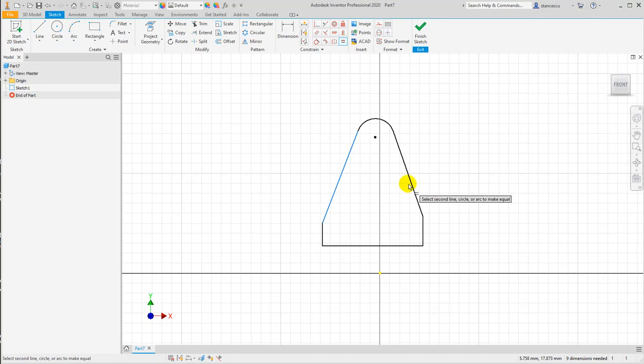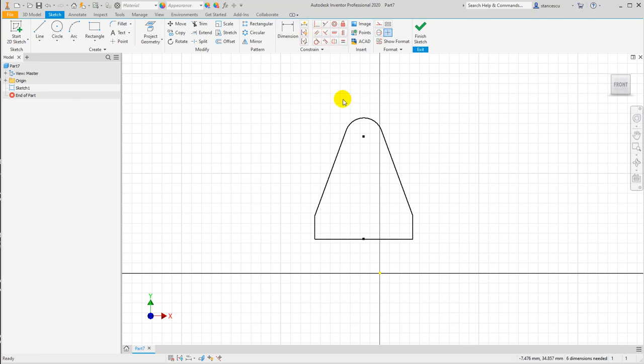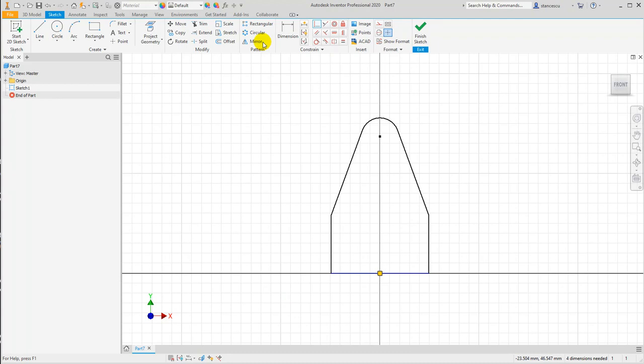Equal, vertical this with this — the same vertical — between this point and the middle of the base. When this is not enough, because you can see I can do this, the tangent here is missing. Let's put the tangent and again you see what happens. This is okay. We apply coincident between this point and the origin. And now dimensions: 45, 66, 10, and radius of 10.